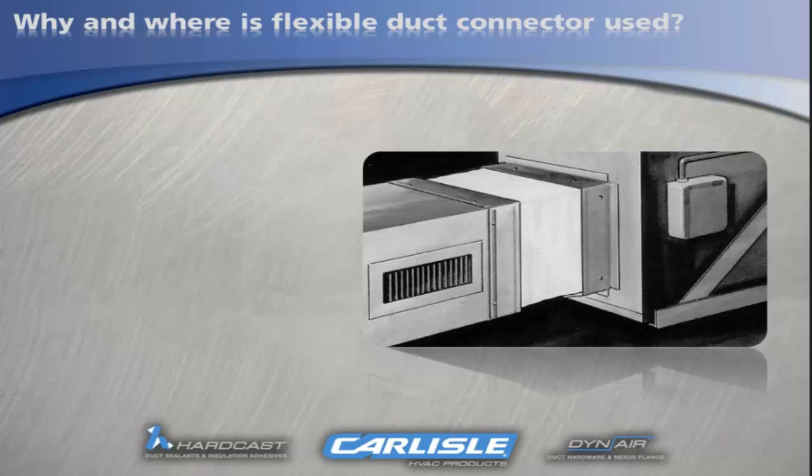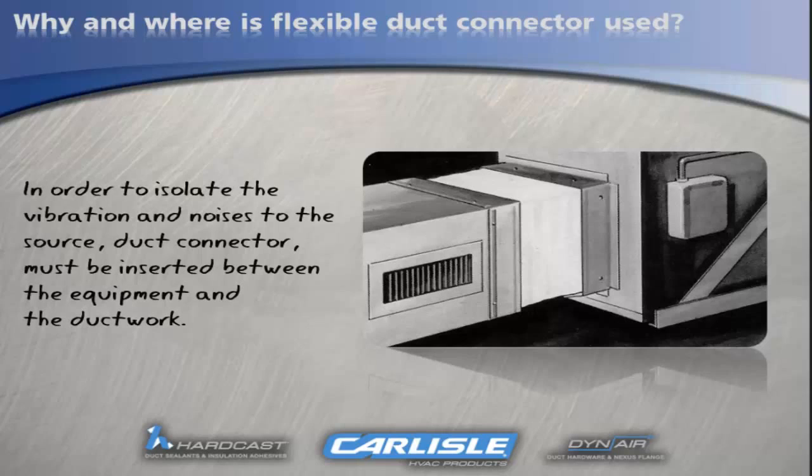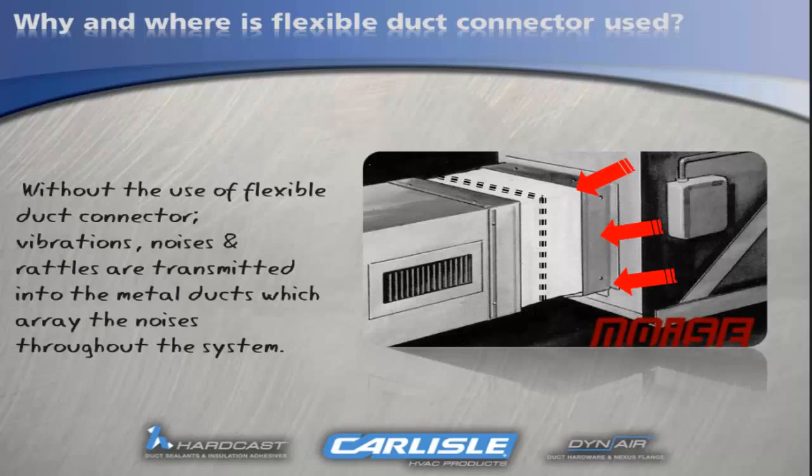Why and where is flexible duct connector used? In order to isolate the vibration and noises through a source, duct connector must be inserted between the equipment and the ductwork. Without the use of flexible duct connector, vibrations, noises, and rattles are transmitted into the ducts, which array the noises throughout the system.